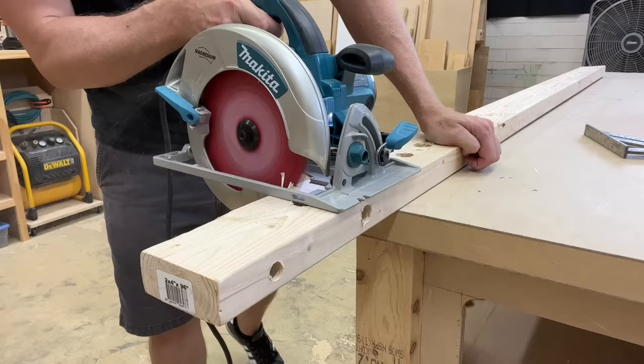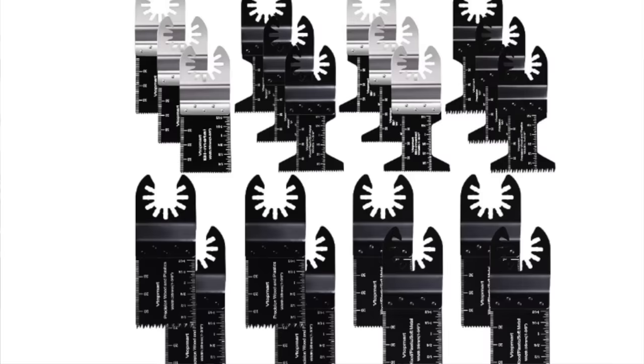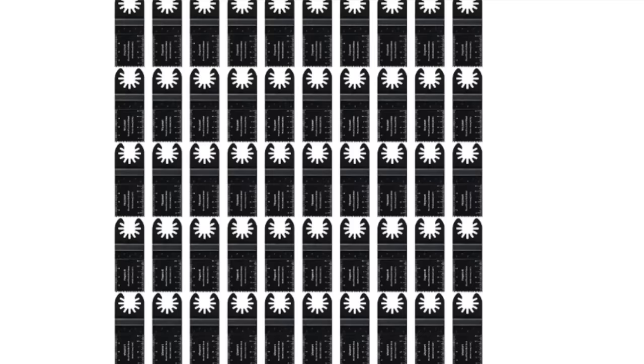Mistake number six is a kind of universal fail: using dull blades. You could say this applies to all power saws, and you'd be right — but it applies most to multi-tool blades. Circular saws and jigsaws can basically muscle through dull-blade cuts, but multi-tool blades dull out fast and become almost useless when they do. The small teeth get filed down, usually in a dip pattern at the center of the blade, and now the multi-tool is like a flat scraper just gnawing at wood. Keep an eye on your blade teeth and change them out when they start to wear. I tend to order bulk off-brand replacements because they're much cheaper and abundant. Diablo has put out some seriously good long-usage blades, but they are considerably pricier than generic brands. Keep your blades sharp — the tool really can't do anything without those tiny points at the tip.